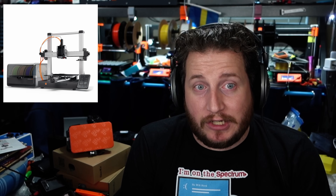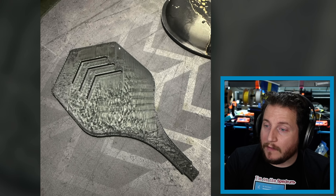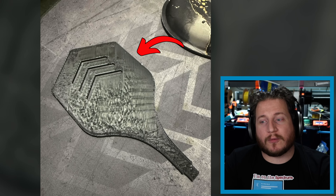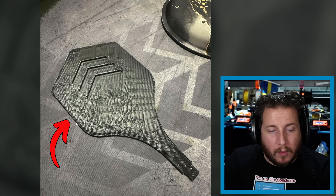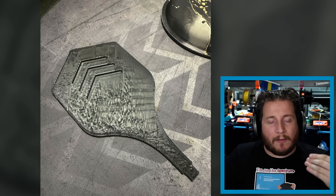Because the Cobra 3 is a Cartesian printer, it has two lead screws that run the Z-axis. If those are off a little and bind as it goes up, one side might go up while the other doesn't move at all. If we look, the issue is not nearly as bad on the right side as on the left, and it gets progressively worse toward the left side — that tells me we have unevenness in our X-axis. These are easy to check and fix. Make sure the V-wheels are tight, they're not wiggling too much, and all the bolts holding this machine together are not loose. Backlash can be created by anything that's loose.